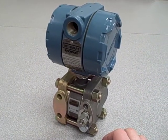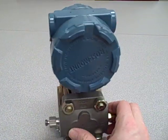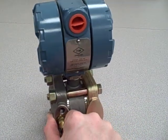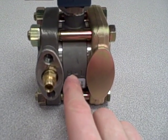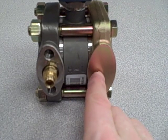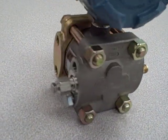What we're looking at here is a Rosemount Model 1151 Smart Gauge Pressure Transmitter. It looks remarkably similar to a differential pressure transmitter of the 1151 series, however there is one noticeable difference. If we take a look at the capsule assembly — the actual housing that contains the sensor measuring the pressure — we see a high side and a low side, but if we look carefully at the low side, we'll notice there is no port as there is on the high side to apply a pressure, and neither will you find a port on the other side.